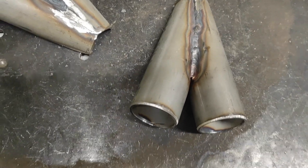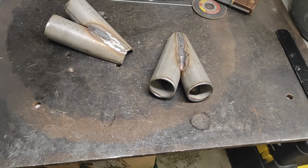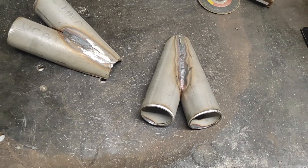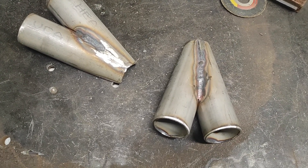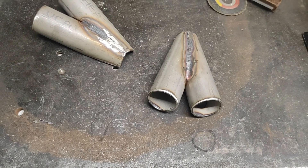What I'm going to do is buy a proper metal cutting blade instead of the abrasive disc I had before, and I'll probably put it in the mitre saw rather than the chop saw, then adapt the jig to make it all work and cut some new pipes.